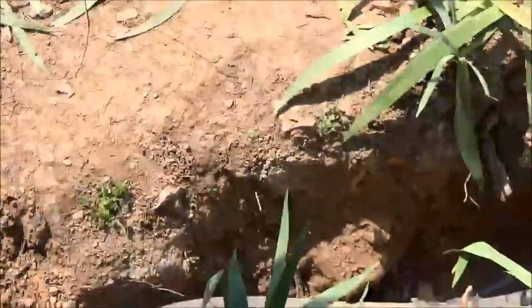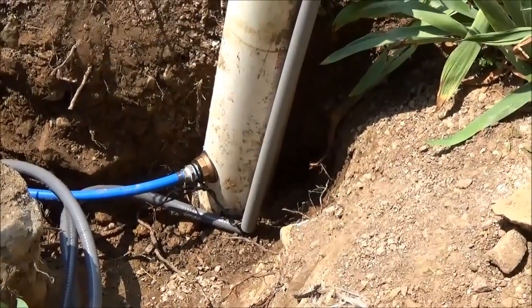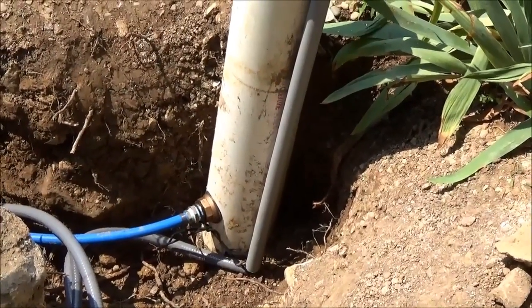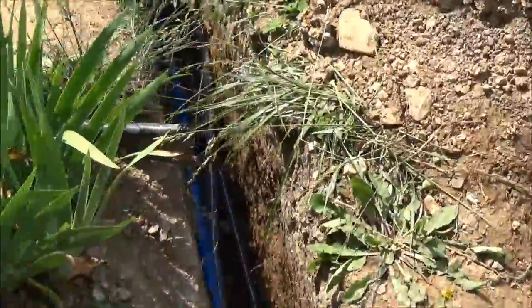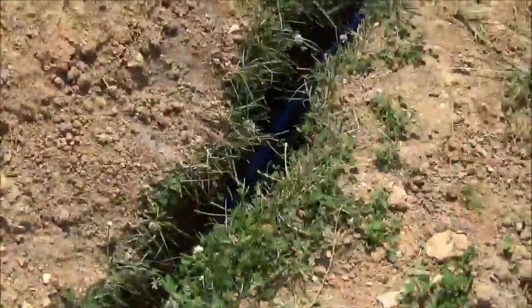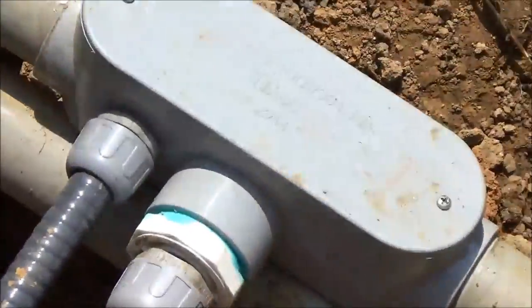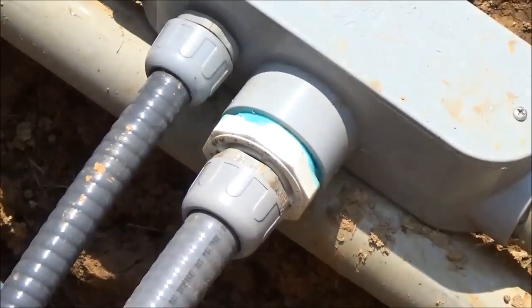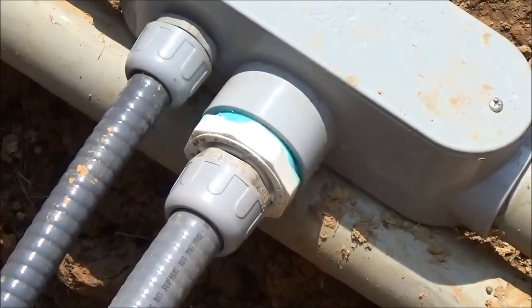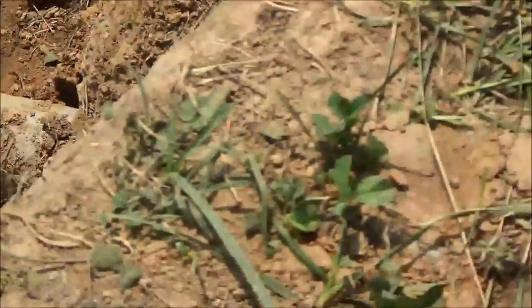We hung the submersible off of a pitless adapter. There's another pitless adapter for their regular pump, so we have two connections and then we're taking off to the trench. We've done a lot of wire pulling and plumbing here. Fortunately, there were some existing conduits we took advantage of. I have tank full on the left and high voltage on the right — I'm separating my low voltage and high voltage. The right conduit carries 135 volts from the array heading down into the house basement.